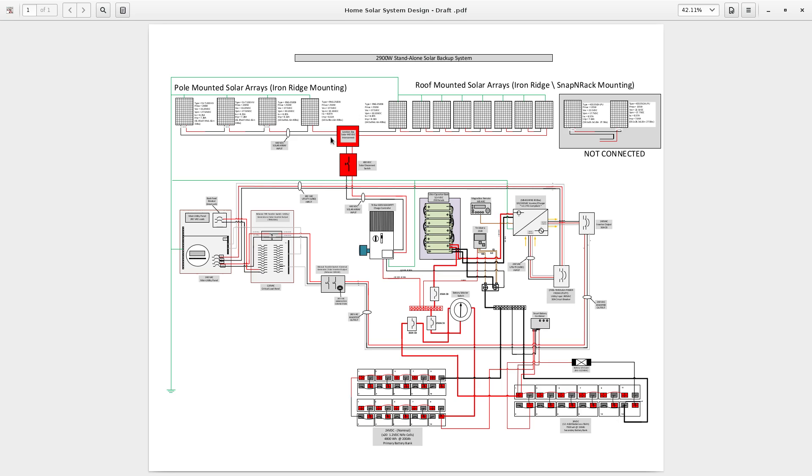These solar modules are connected together in series — positive and negative, positive and negative, all the way through. All of them connected in series gives me a potential of 440 volts DC open circuit. This is one huge string, one huge array, and all of these panels interconnect together in this junction box.